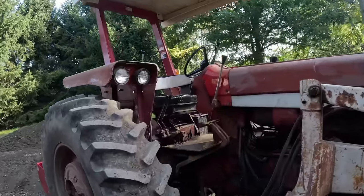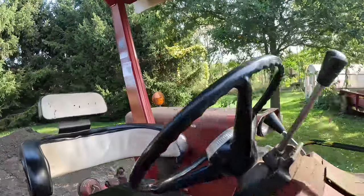So say you've dug out a basement and you're gonna pour a slab and you're right on undisturbed ground, you can put clean stone in as a base for the slab, and you don't have to run a compactor. So there you go. We're going to finish getting this graded off.